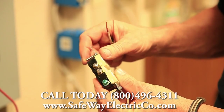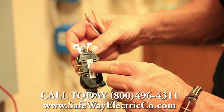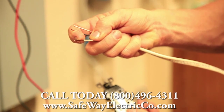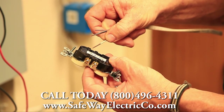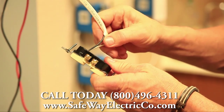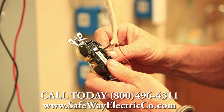One wire goes underneath this screw and the other wire goes to this screw — if you have two whites going on to the next outlet, that's one method of wiring this receptacle. On the back of this receptacle it also has four little holes, and if you wanted to you can strip the wire insulation off and instead of wrapping the wire around the screw, you can push the wire in the back of the receptacle just like this.